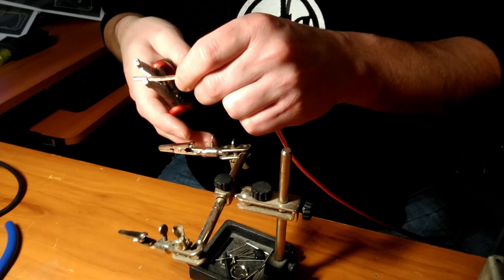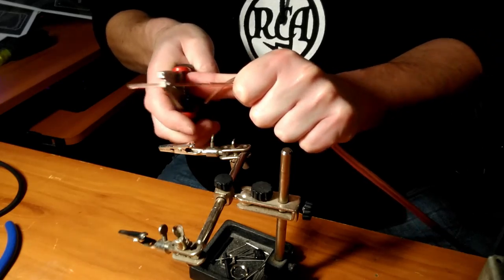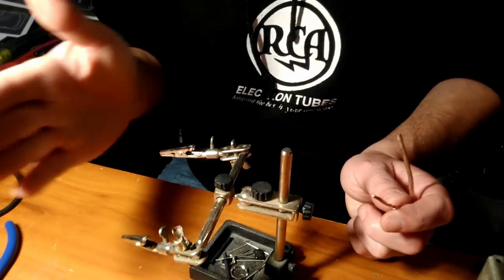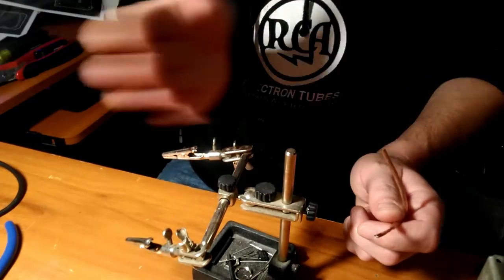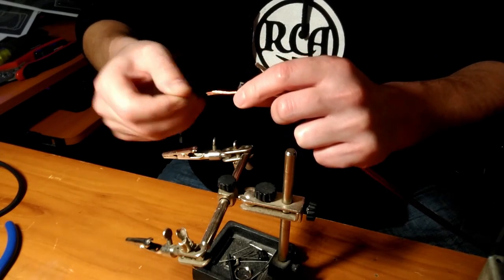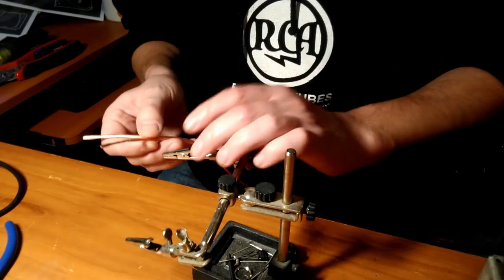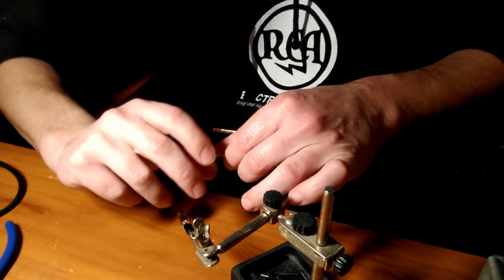And what happens is, if you have overrated speakers, it's like buying a Ferrari, and when you drive it, you don't go past 2,000 RPMs. The amp won't be able to drive the speaker in and out the full range of its motion. And so you'll have poor sound quality. Reduced bass, might be shrill and cold sounding. So that's why we weren't looking for big giant 1,000 watt speakers for this amplifier.